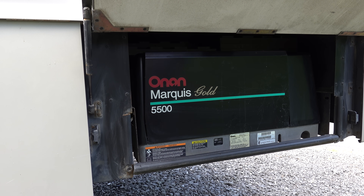What's interesting is that the primary purpose of our generator these days is being used as a battery charger, which is kind of weird, right? We don't really have a need for a large generator since we have 12-volt air conditioners that don't use as much power as the old power-hungry ones did. So the 5,500 watt generator we have is really oversized for what we need — it's just a big giant battery charger. But when we do fire it up, we can do that while driving or when we're parked.